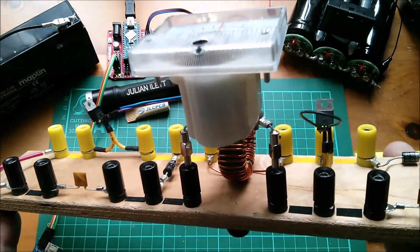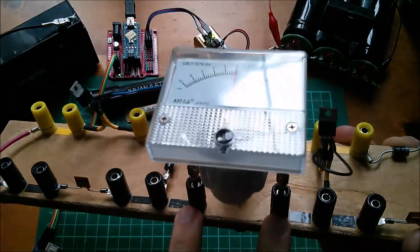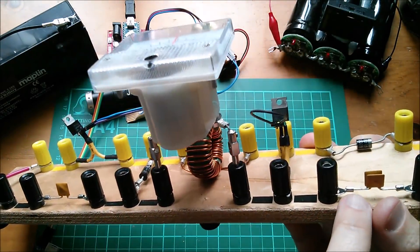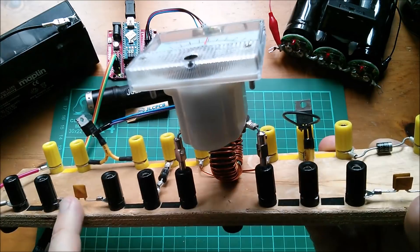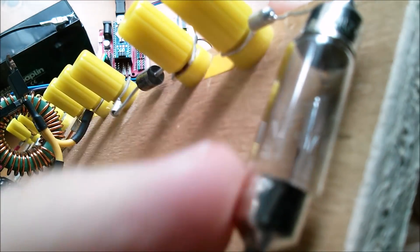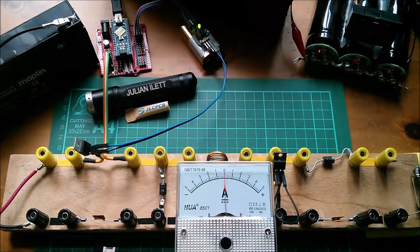Let me lift this up so we can see how the meter's plugged in - it's wired into banana plugs on the negative side. I've got a 1.6 amp fuse on one side and two fuses in parallel giving 3.2 amps on the other. Why a higher current rating fuse on one side than the other? Have a think about it. Also notice this poor 5 watt bulb - in the last video doing boost experiments it went quite blackened from 20 volts.